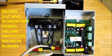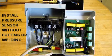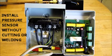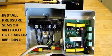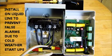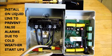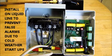The copper watcher pressure sensor is connected to the liquid line service port of your air conditioning system using a swivel T fitting, which is provided in the install kit. The main reason the copper watcher connects to the liquid line and not the suction line is that conditions on the suction side could cause pressure to fall below the set points of the pressure sensor and cause a false alarm. On the liquid line, there is no such condition — pressure is always available.